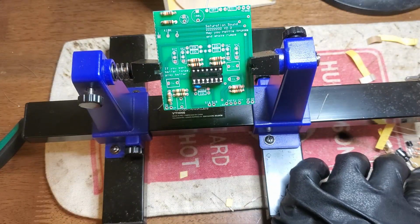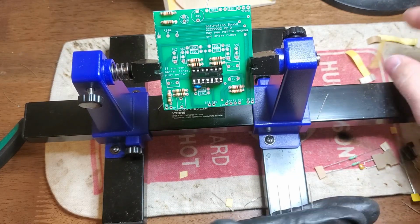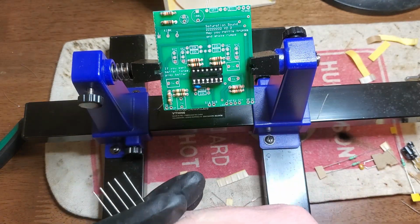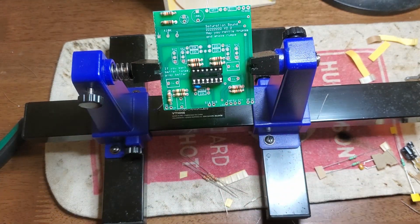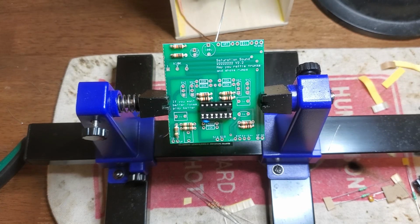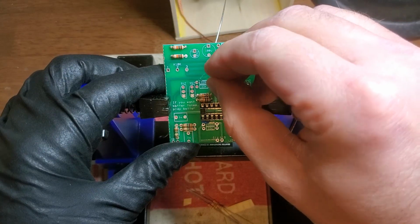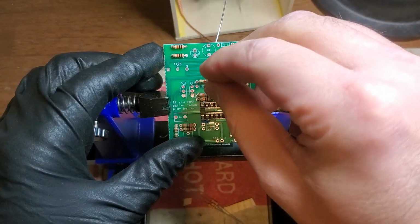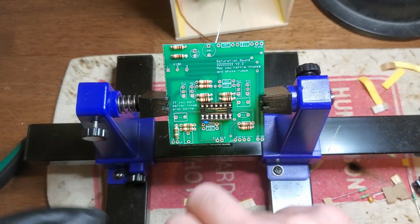Now we actually get to the namesake of the pedal. People who talk to me behind closed doors would know that the reason for the name of the pedal is threefold. I want it to make people's eyes hurt. I want people to sound like they're having a stroke when they say it. The actual wavefolding network uses a quad of 22K resistors. So 22, 22, 22, 22. 22 by 4.